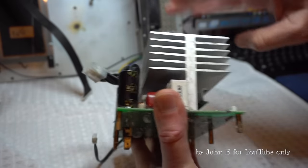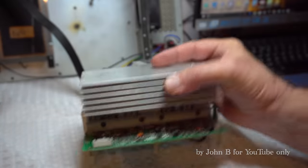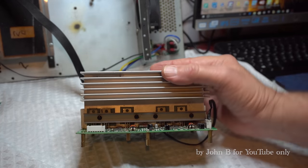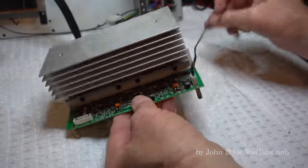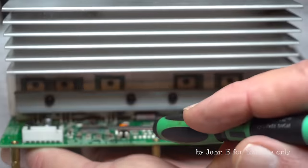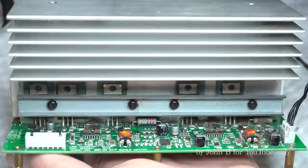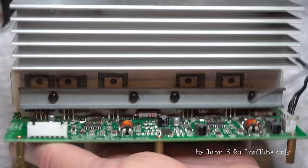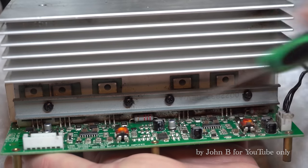If you look at this 1801, without the circuit drawing and breaking it down, it looks like a bit of a nightmare, but have a look at this. Now, I had a look at a couple of seconds ago. If I can zoom you in a bit. This looks like it might be really easy. So these two chips here, PV, use the IRS2092. These are IRS, I think they're 2095. So the 92s are not directly compatible with the 95, but these are a current chip and you can get them for a few pounds each.